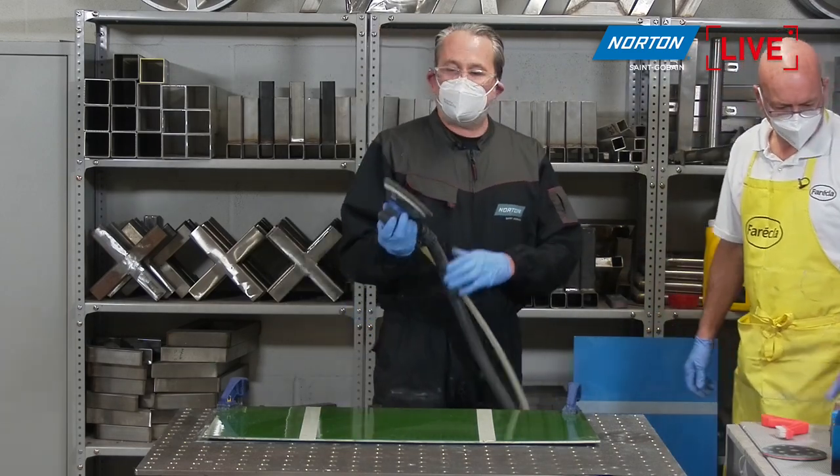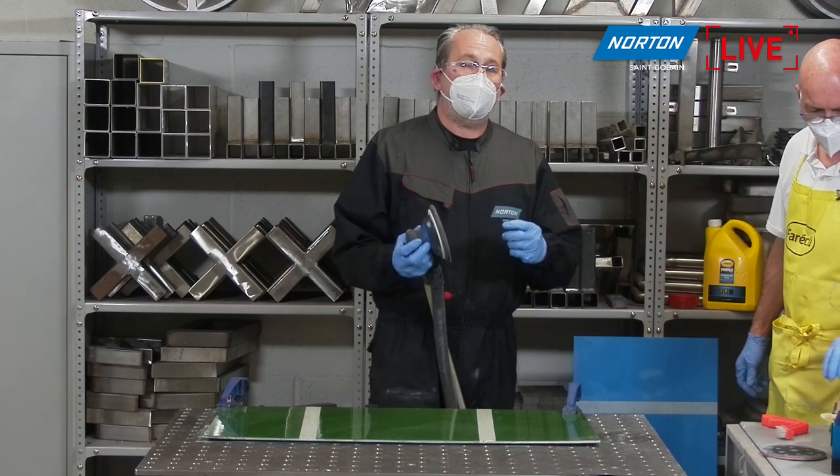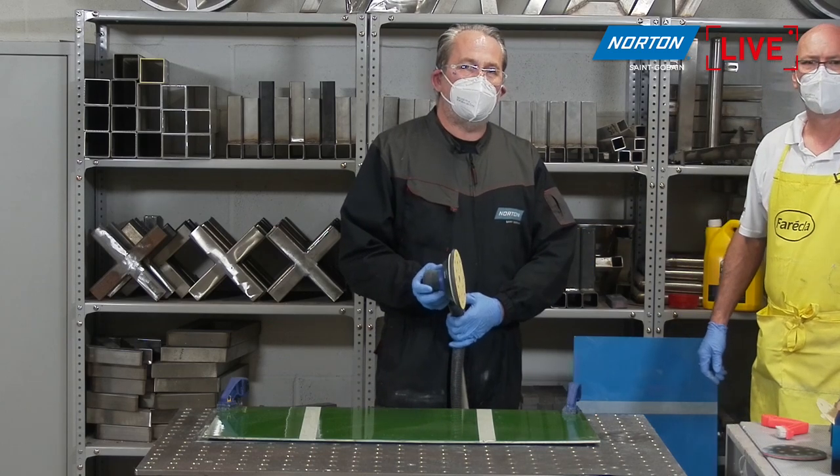Okay, so I'll get on sanding. So start with P400. I'm going to go to 600, 800, 1200, and then finish with a 1500 before I pass over to Mark with his compound. So let's go.